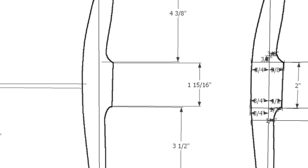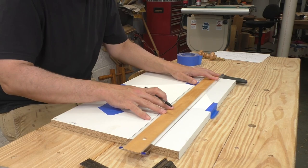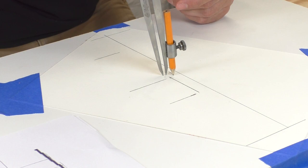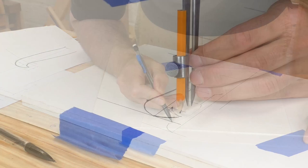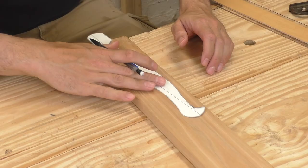I started with my photograph of the original saw, traced it in Photoshop, and then moved it over to SketchUp, where I could measure it and figure out all the curves and details. I wanted to make a pretty faithful replica, and that's not easy when you're working from a quick snapshot you took over breakfast. Then I went to paper and drafting tools. I could have just printed out the stuff I did in the computer, but I wanted to work full size and get a feel for the curves and proportions of the tool. I used a drafting square for the lines, a compass for the curves, and some stuff I just did freehand. I love digital design, but when you're going to make something you plan on holding in your hand day after day, you might just have to sit down and draw the damn thing.